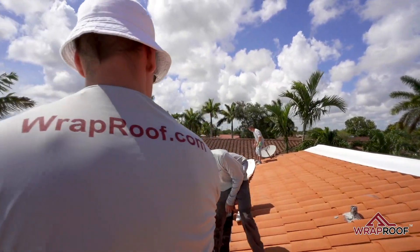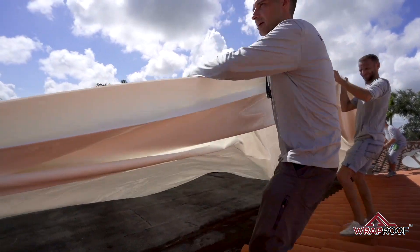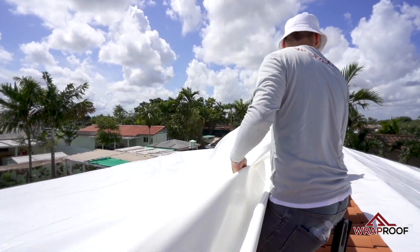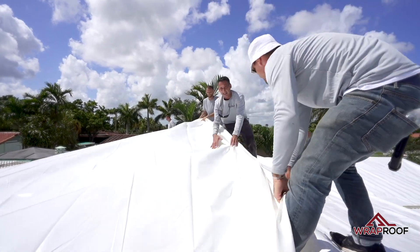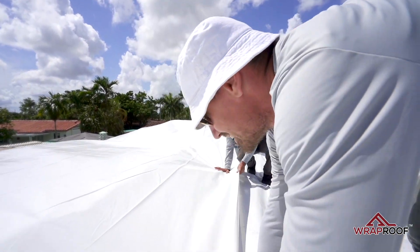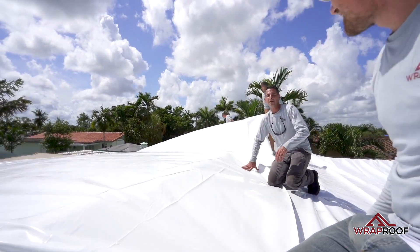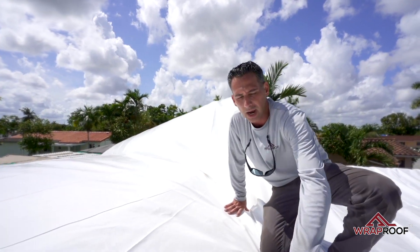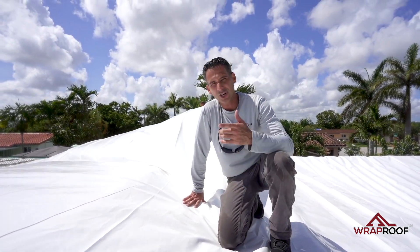Let's go ahead and open up this plastic. You want to make sure you get the plastic over any kind of tear point. Pull it from the center, keep rolling it out, and keep it low — because with the wind coming in, you don't want it to catch. Stand low, pull it around, lay it down, and then you're going to put some preservation tape down to hold it in place before we start the heat.